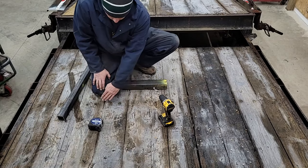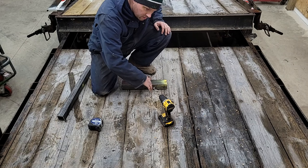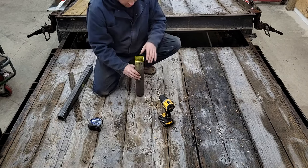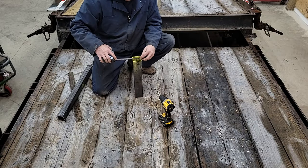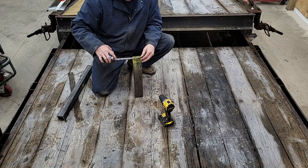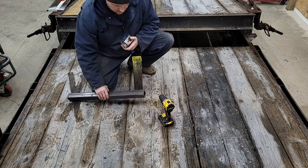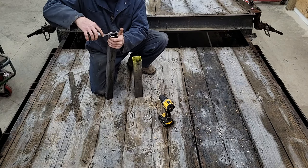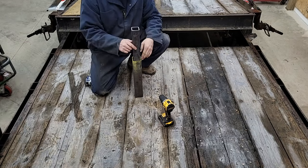There's a brace that goes right through here, and there's another brace that runs this way. So that's where I'll weld that tube down in there. So this is two and a half OD, it's like 2 1/4 ID. And then I've got this, which is probably 2 inch OD. Yeah, 2 inch OD. So it'll be a loose fit, which is fine.